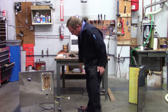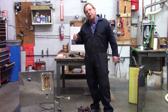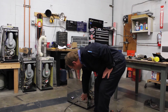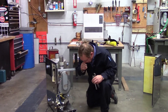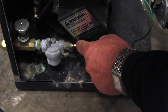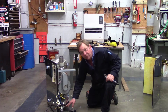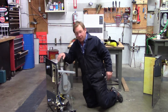On this side over here, I'm going to remove my oil line coming from my far right safety valve to my fuel pump, so I can leave this whole section tied together — my electrical side and everything — when I go to take this apart. Just a service note: when I'm looking down inside here at the brass fittings, I can see that these brass fittings are very, very dull, and my copper piping inside is very, very dull.